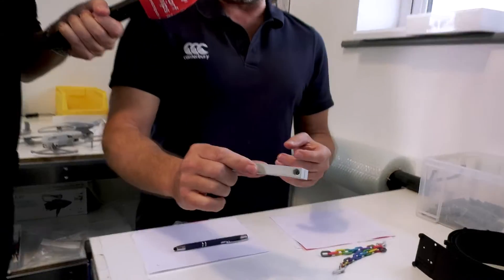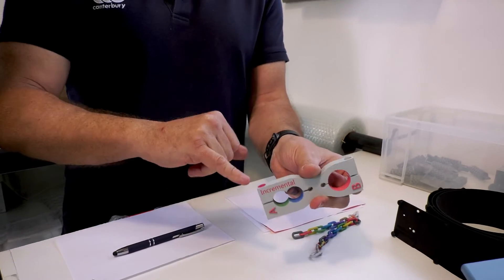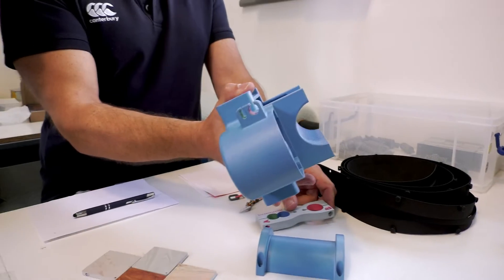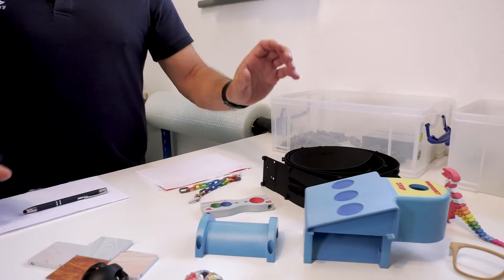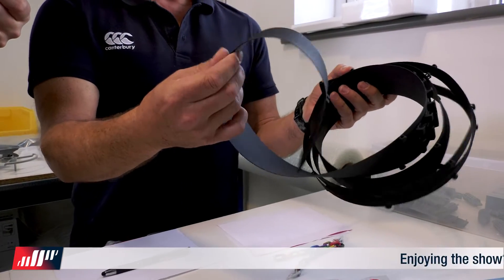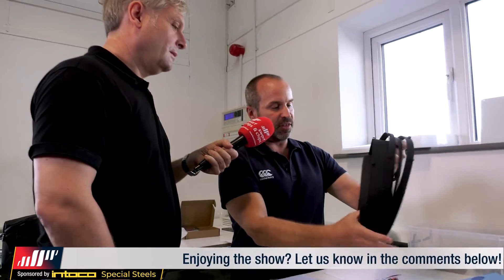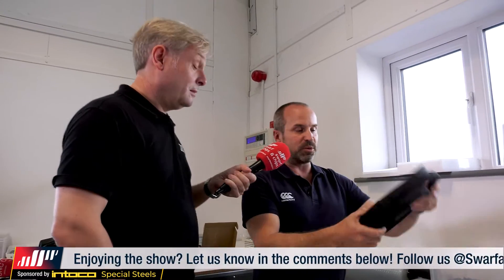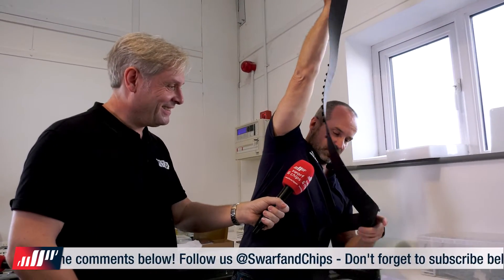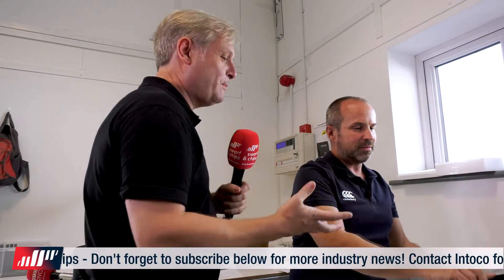Last one - another piece from the colour printer. We can put text into it, we can put assembly guides into it - put the nut in the pink hex, put the pink bolt in, put the rod through the green hole - identifiers to help users. Another one out of the production printer: if we lightweight the material enough, we can get it down to pretty thin flexible parts. This is 0.7 of a millimetre thick and just over two metres long. It was printed nicely coiled up in the printer and then we can unravel it afterwards to give a pretty unmanageable monster of a part.